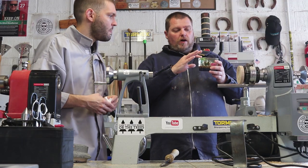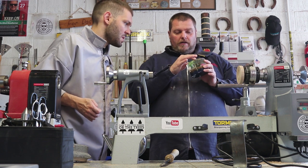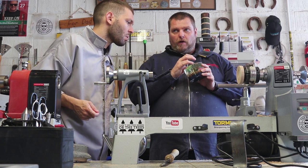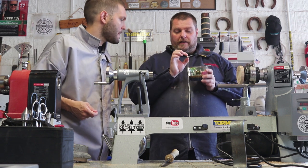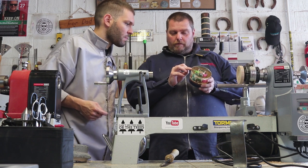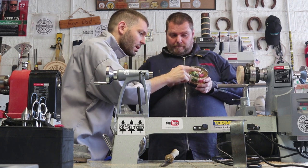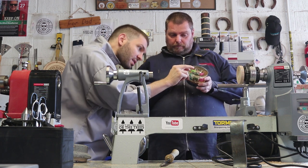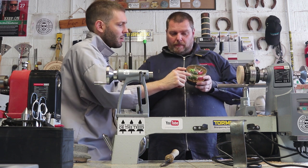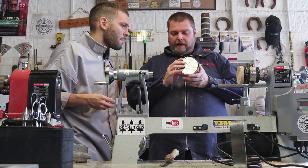So, this is the top. This is what you're going to have the shot glass on. You need a very, very small recess. And how far does the stuff inside come up? Not that much — the curve of this can be about half a centimeter to a centimeter. Right, so we're going to round this over. Very carefully. Yes.